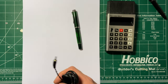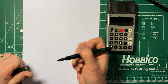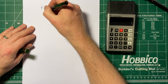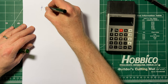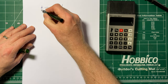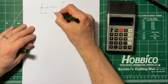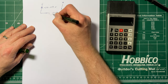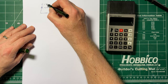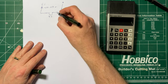There's a USB-based charging cable. So let me explain the reasoning. Earlier on I used a diode to drop the incoming voltage by about 0.5 to 0.7 volts. So you've got 5 volts here, and then coming into the calculator you'll get 4.5. But we know this isn't really 5 volts — it's like 5.1, 5.2 — so there'll be some variation. But the diode will still provide a voltage drop of about half a volt.